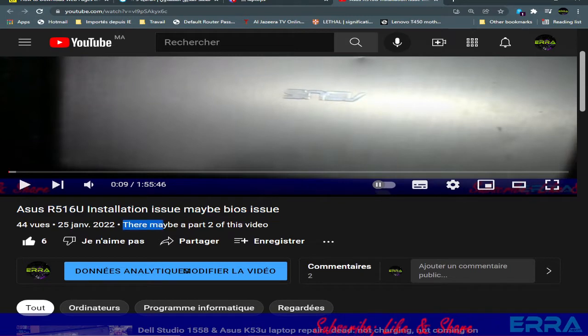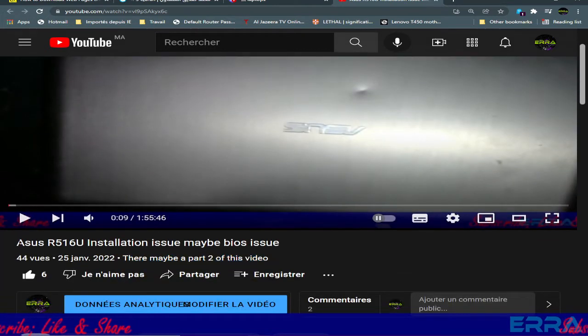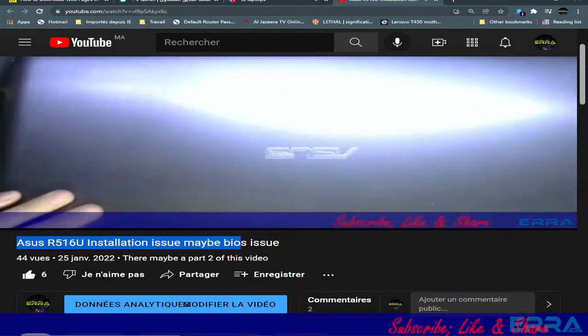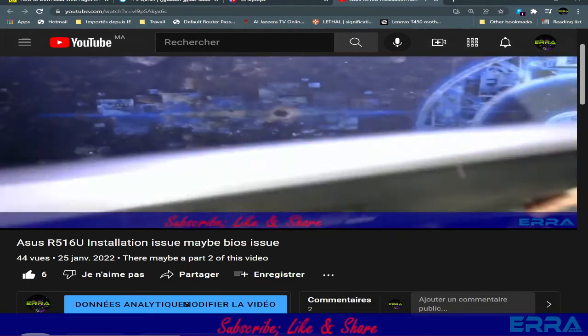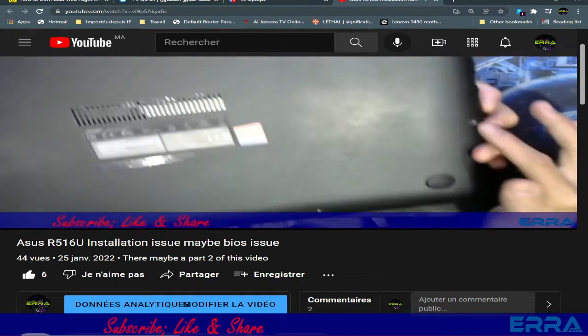As I said there might be a second part, so here it is. Sorry, I didn't manage to do that with the laptop. The laptop was recorded by the shop which brings it to me. That was done quickly, but as I said in the previous video, the issue was also with the BIOS region, which has to be repaired. So what I have done is I downloaded the latest official BIOS update from Asus support, and replaced the BIOS region of the dump with the one from the new file downloaded from Asus support.